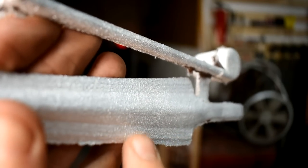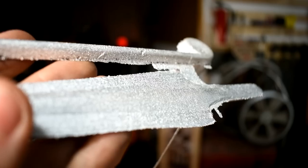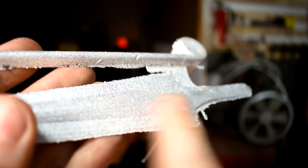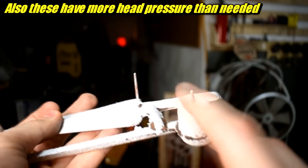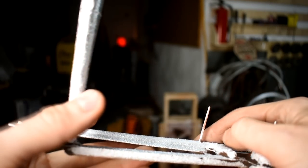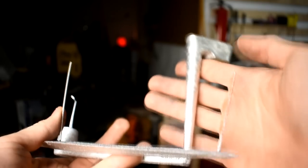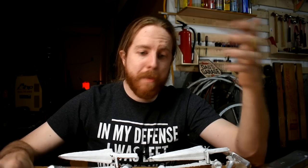The just right casting - you can see those grooves that are in the pattern, the long grooves, where the too hot one you can make out the grooves but they don't show up quite as cleanly. The surface finish isn't quite as good, probably because the metal is so flowy it conforms to every sand grain a lot easier. With the just right one we didn't have as much shrinkage and it still filled the whole mold. Clearly the right temperature is the right temperature. The big surprise is that the too hot one isn't riddled with holes or cracks. So maybe gating matters a little more, although temperature obviously does matter. Other metals might have different problems when poured too hot.